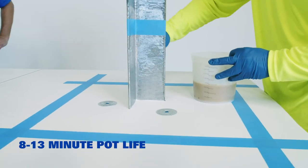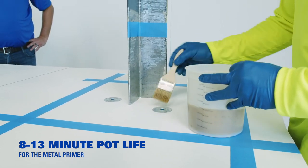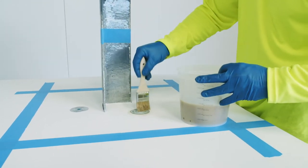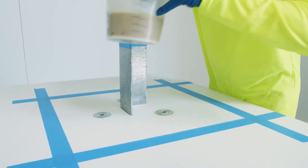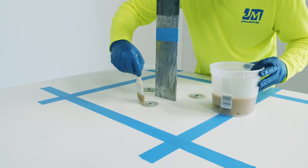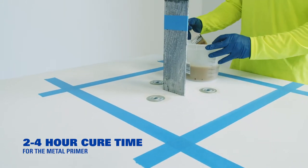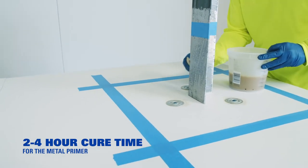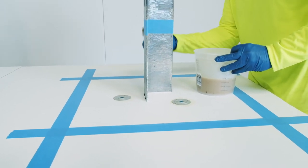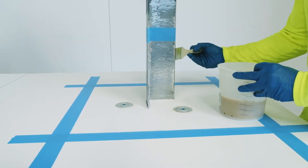It's going to be about an eight to thirteen-minute pot life on this primer — it's pretty quick. So if you've got more than one penetration to do, get those all prepared and ready to go so you can get them all primed up using the same pot. The cure time for the metal primer is going to be dependent on environmental temperatures, but you're going to be somewhere between two and four hours, and then you'll want to get that covered up with resin within about 24 hours. You can use this primer on other penetrations as long as you get back in a timely manner to cover them.